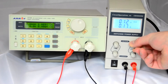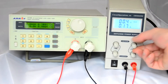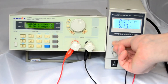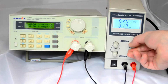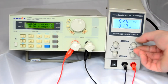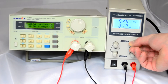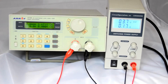Setting the voltage up. It's actually very responsive — updating almost in the microvolts, really precise. When you're below four volts, you've got three decimal places of precision. But once you get to four volts, you hear a relay click, and it switches over to a second circuit for higher voltage ranges, giving only two digits of precision. So under four volts: three digits. Over four volts: two digits. They've got a different circuit that switches in and out based on the voltage.